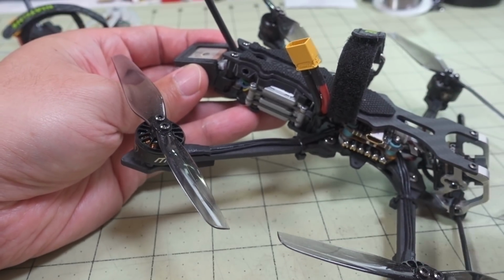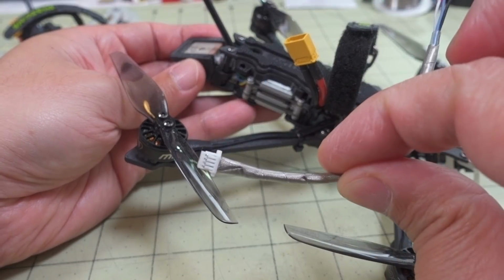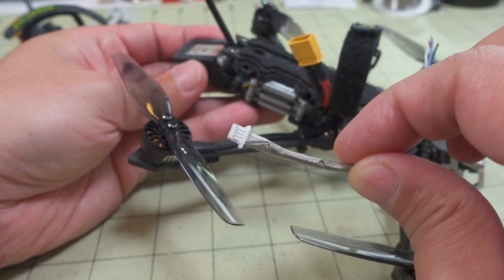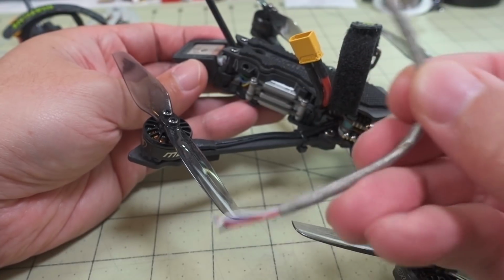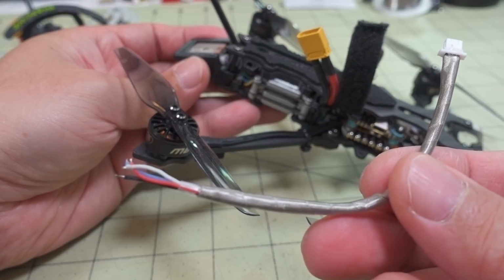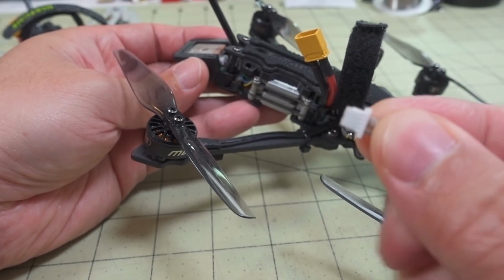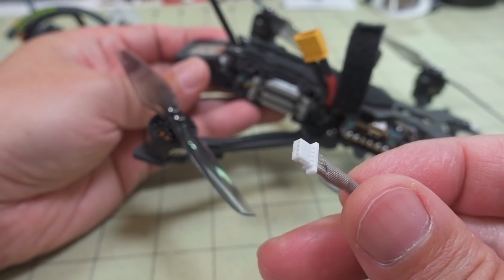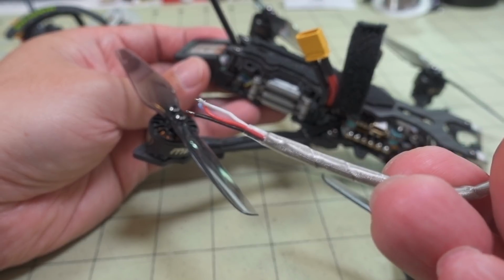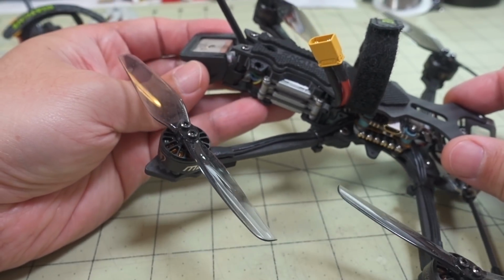So pretty inexpensive part. I'll link that down in the description. You can come up with Race Day Quads. I think you get two in a package. So yeah, if you have other quads that have problems getting good satellite signals and not getting enough satellites, you probably want to pick up this cable. You can just cut off the connector if your GPS is using a different connector, of course. And of course, they all use four wires. You know, they have power, ground, and RX and TX.